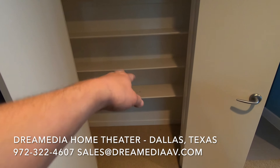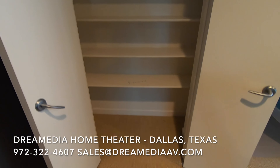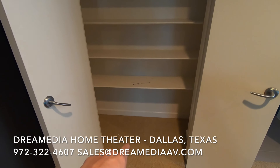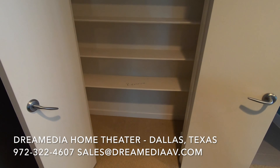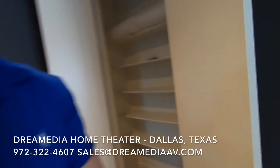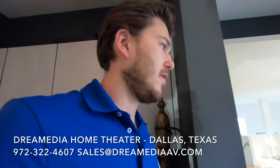All of our equipment is going to be terminating back here in the closet. I'm going to knock out a couple of these shelves and put in a floor-standing rack — I'll be using the FS series 15U rack. We're going to be pulling in power down there as well as all our speaker wire, and I'm also going to hardwire back to the router a CAT6 line so that everything is operating as quickly as possible. Attic access is somewhat limited on this project.